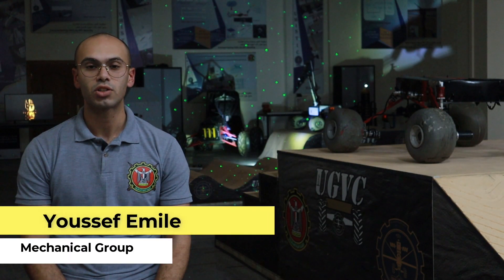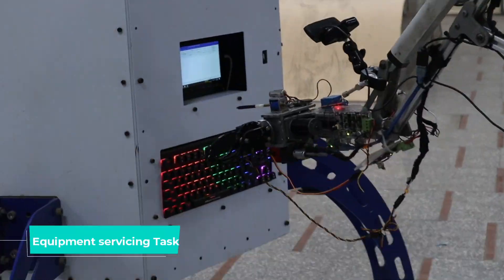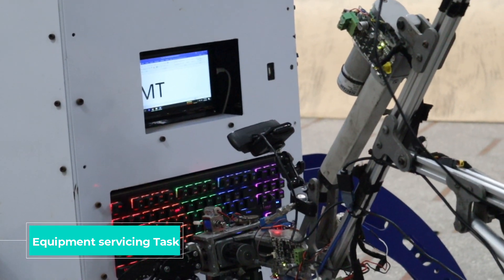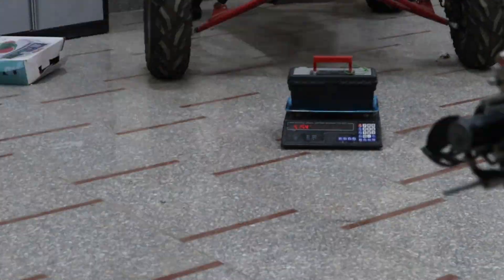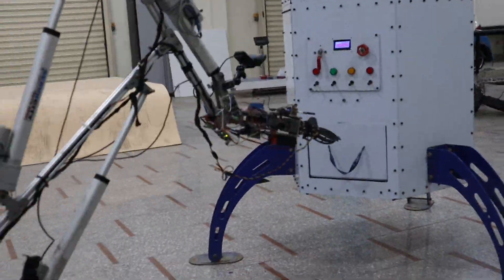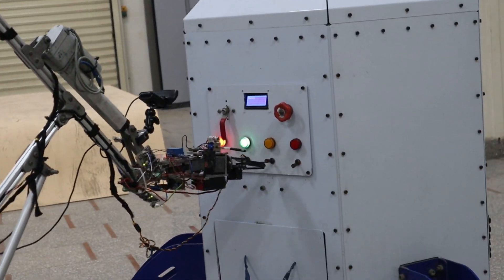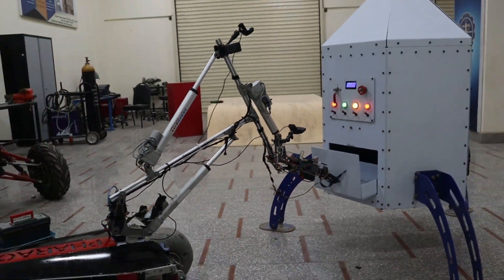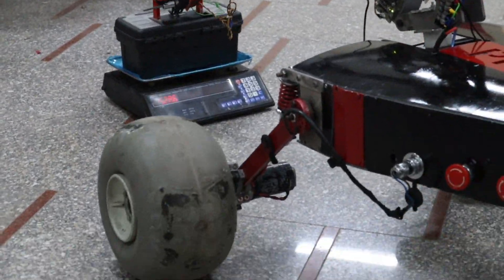For the robotic arm, we are using linear actuators due to their high torque-to-weight ratio, easy control, and easy fabrication. The linear actuator is attached to an aluminum profile with a steel base which rotates 360 degrees, with a DC motor connected to a worm gearbox that has a high gear ratio and a safety lock, providing 6 degrees of freedom. For this year, we designed the gripper Agrippa, using servo motors with spur gears to transmit motion and multiply torque to achieve tasks easily and rapidly.